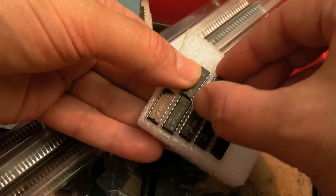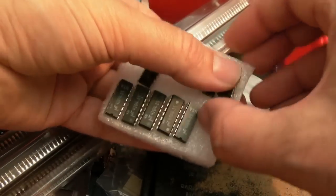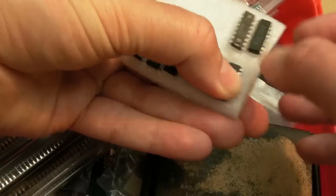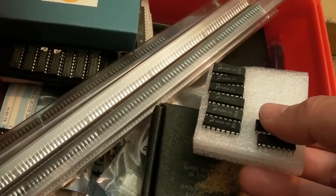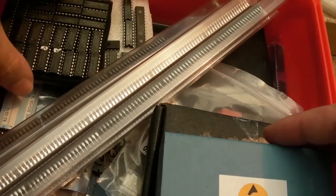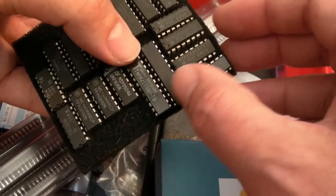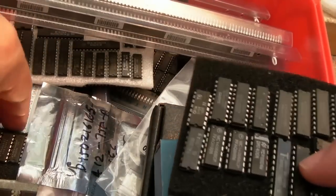So yeah, we used two RAM chips to fix the previous two C64 videos you've seen recently. So we need two more. So I'm going to use those MT ones. Yeah, I know what you're thinking, MT, it's unreliable, you should just throw it away, but these work. Why would you throw something away that works, especially when it's socketed? I'm not soldering these on. If someone had a RAM fault, they could just swap the chips over. So I suspect these are the same thing, actually. Anyway, I'll just keep looking, I'll report back in a sec.